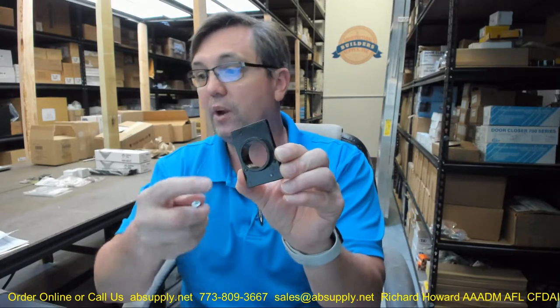Then you're going to get two bolts. I believe they're 8-32. It might be 10-32. They'll go through the door, 2-inch flathead screws. Yeah, they're 8-32 by 2-inch. They will go per the template through the door. You'll countersink the inside face, and then you're going to attach them here.